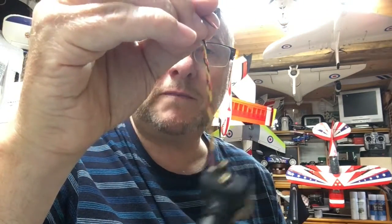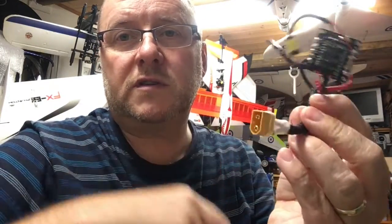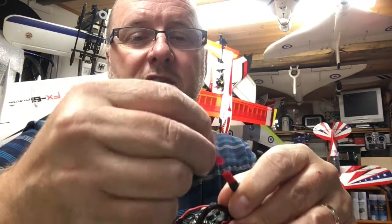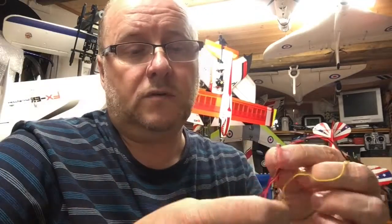So it's quite simple, however you do need to do a bit of soldering. There's your power distribution board and you've got a 12-volt supply out. I would get your quadcopter built and not worry about the FPV until it's up and running and flying. When you're ready to put the FPV in, you have your 12-volt plug there ready to go — that's going to plug into your VTX. And there's your camera lead. The VTX feeds the camera, so that's the simplest way of doing it.